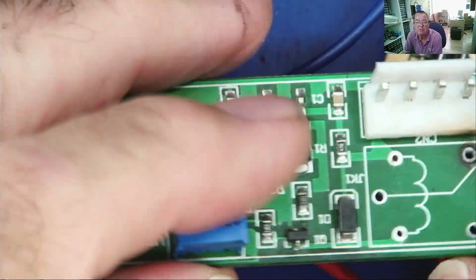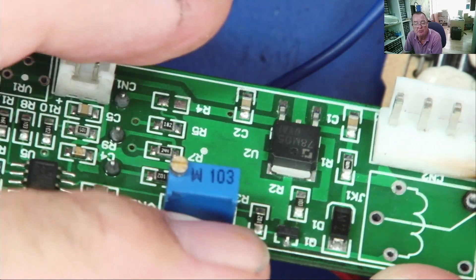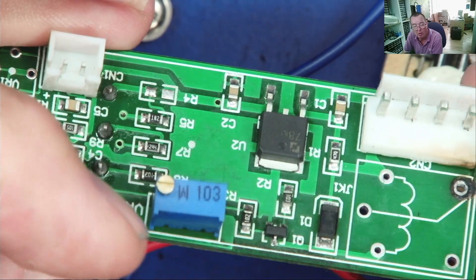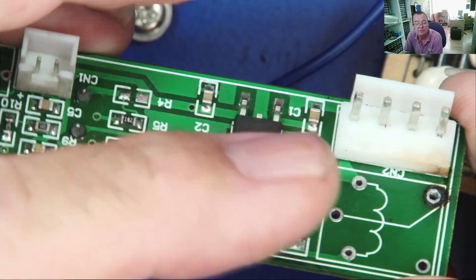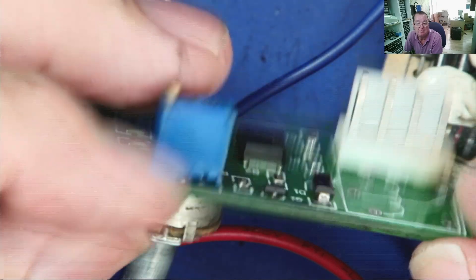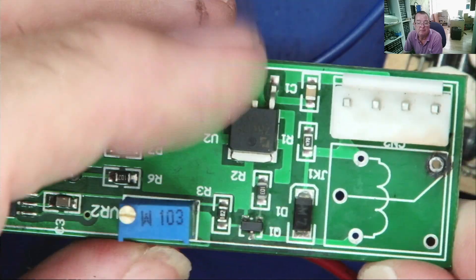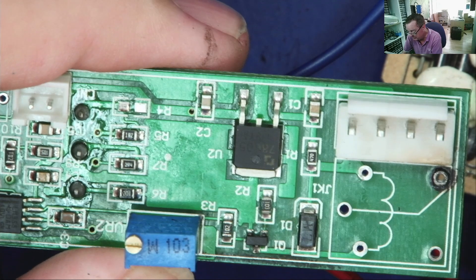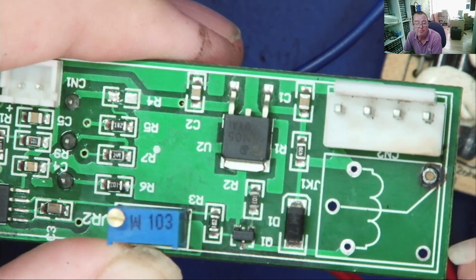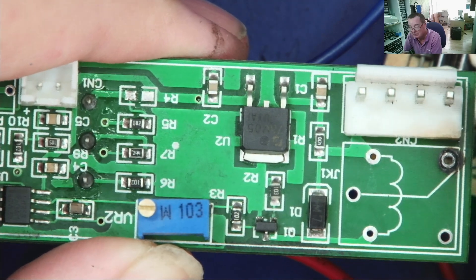When you're looking at stuff like this, bear in mind you can't assume the transistor is turned on to turn the relay on to turn the heater on - it could be the other way. But on ours, it works in the way that it turns the relay on to switch the heater on. So we just need to find a relay - it doesn't need to be a changeover, it just needs a normally open connection that closes when the coil is energized. The coil is 12 volts.